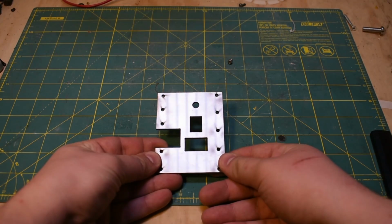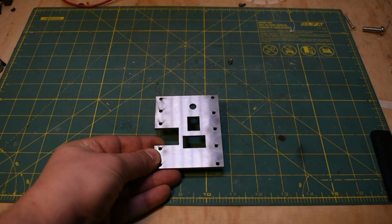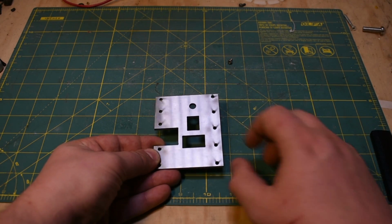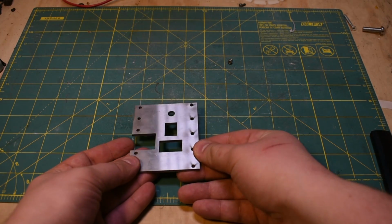One thing, if you were going to water jet this as well, you want the bad side facing up. That's because when the water jet starts to pierce through, it'll shoot the garnet everywhere, and that's what these big V marks are. And then once it breaks through, it's fine. So the other side comes out looking perfect. The side that's facing up gets a little messed up.